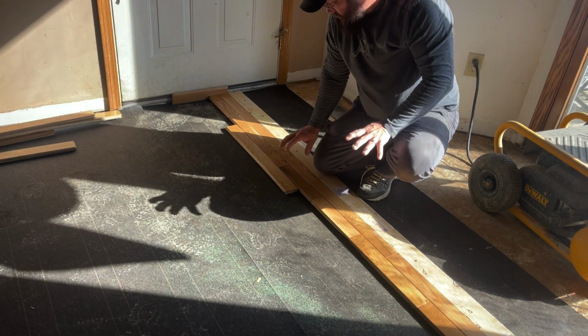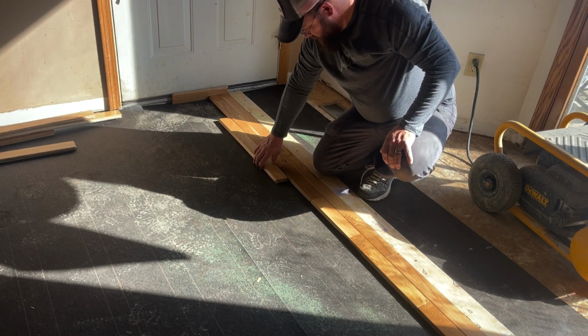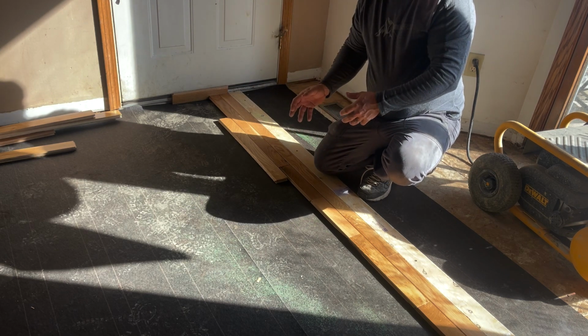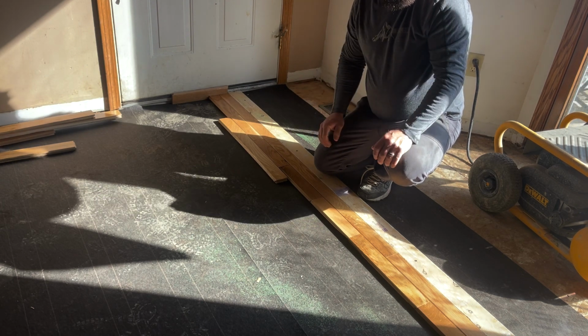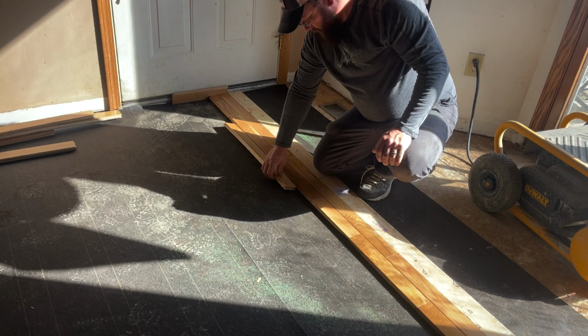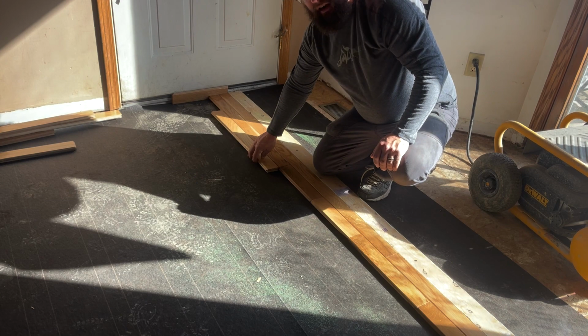You're also looking that you don't get the same pattern all the time. You could step, but then every 6 or 7 or 8 piece rows, you start getting a uniform look. We want a random look here, is what we're going for. But we want it to be a strong connection. That's why we're not going with H's and with them lining up.